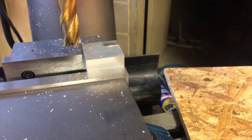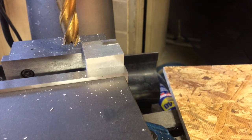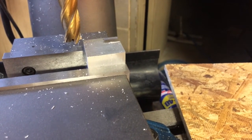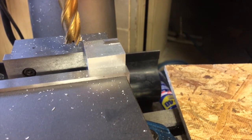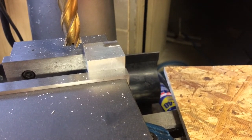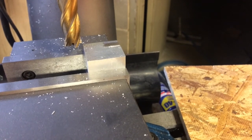That's pretty tough on the manual machine because we have backlash. This machine is a new machine, but we don't want to reduce its life. So we're going to use the up or the conventional method.